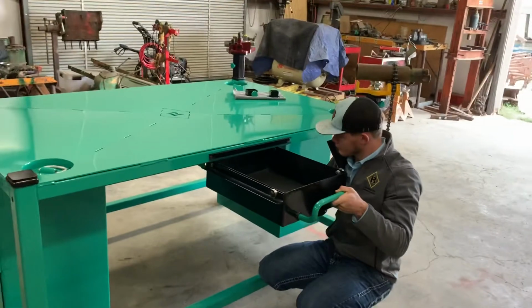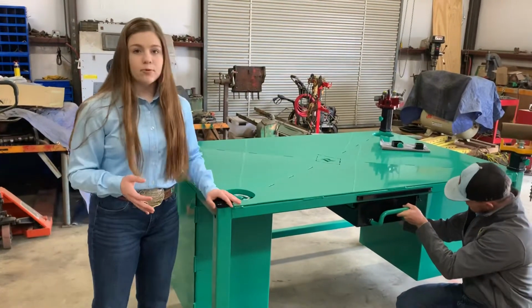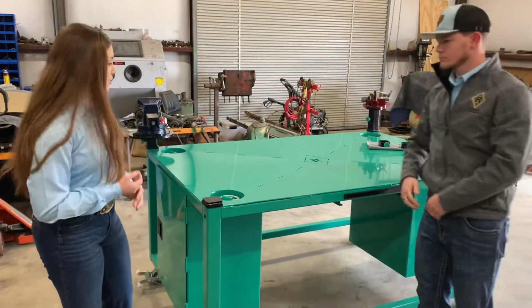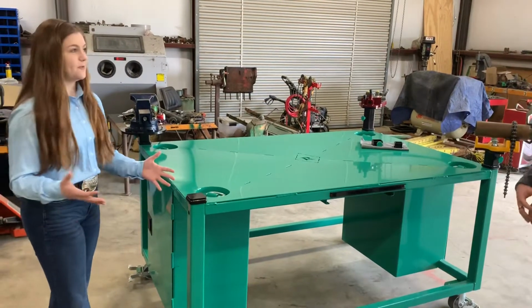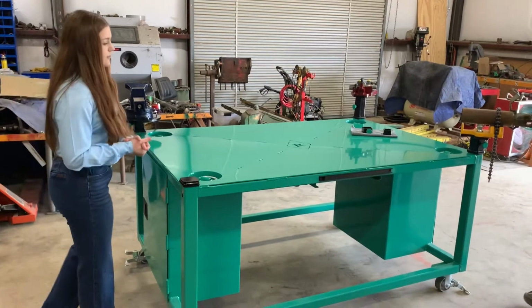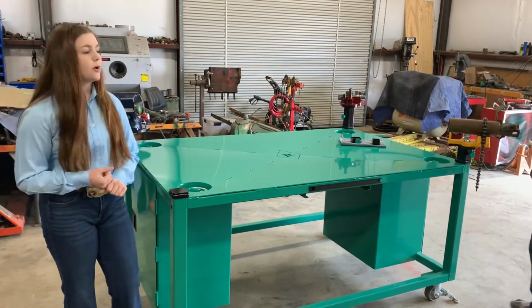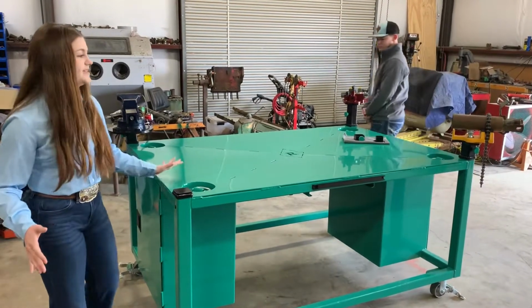And so moving on to our paint process, we first originally did a gray enamel paint that was an 8-to-1 ratio, 8 parts paint, 1 part reducer, and we shot the whole thing gray at first. That's originally how we had it in Fort Worth before the major shows hit. And then with our ocean green paint, we did 4 parts paint, 2 parts reducer, and 1 part hardener. We did about 2 or 3 coats of that just to give it that nice clean shine.